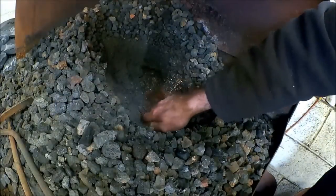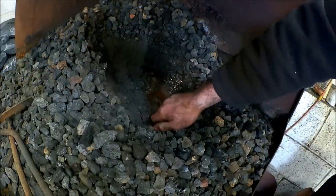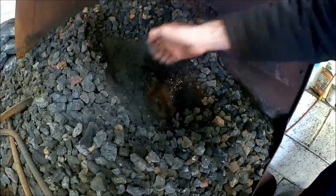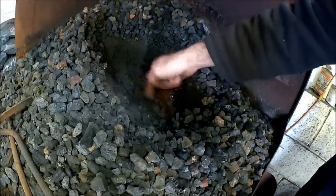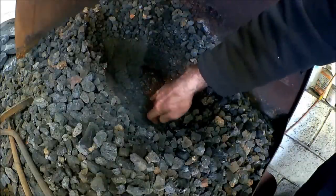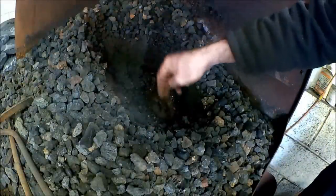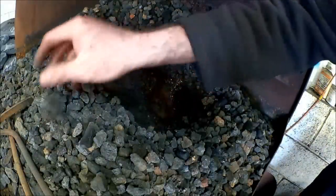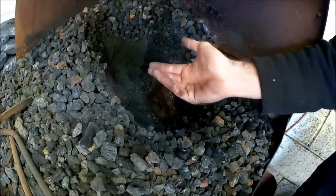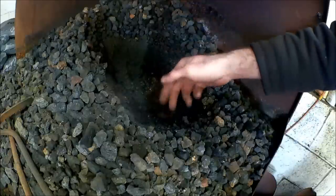This is something a lot of people forget — certainly, I forgot for many years, or didn't understand. When a lot of people clear out this hole — this is just sand underneath here, mainly ash now — people say you need fire bricks and ash to start with. No, I just used regular builder sand. It made nice big clinkers for a little while, and then your ash builds up and you get this natural self-healing, self-forming cup for your fire to go down.